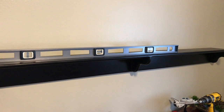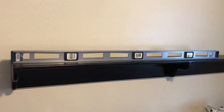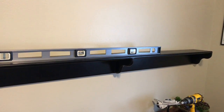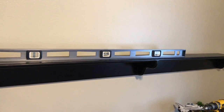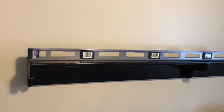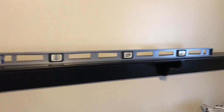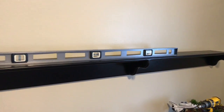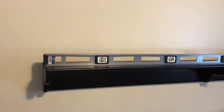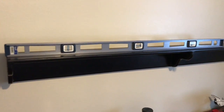This shelf was actually here before — it was screwed right to the two-by-fours. I refinished and repurposed it for my kids' room but I don't want it to be a permanent situation. Keyhole slots are a great way to put a shelf up temporarily but nice and secure, and when you're ready to take it down you just lift it up and pull it away. This is Will It Fits — have a great day.